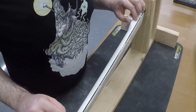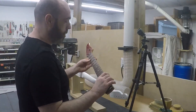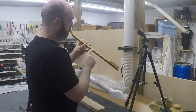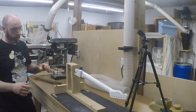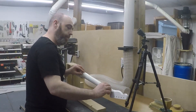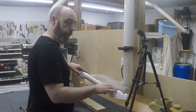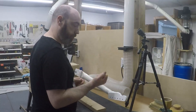When I masked off last time, I masked off so that a significant portion of the fretboard is showing, and I did this for a couple of reasons. I've got this little Kramer neck kicking around — I'm pretty sure that's actual Brazilian rosewood, a really pretty piece of wood. I noticed that they had actually brought the clear up to the edge of the fretboard like that, so I decided that made a certain amount of sense during my process here. After the paint line and the first couple coats of clear, I was able to remove the masking tape and leave a gap there, and that clear that filled in now kind of rounds over that edge. Now I can go in here and sand everything smooth, and that upper edge — when I actually do the fret ends and the fretboard to get it playable — I'll be going over it over and over again with many different grits of paper, giving me a fully smooth, comfortable surface.